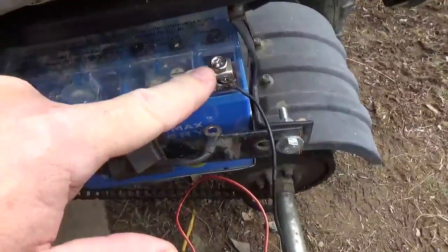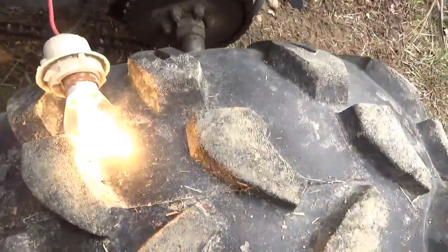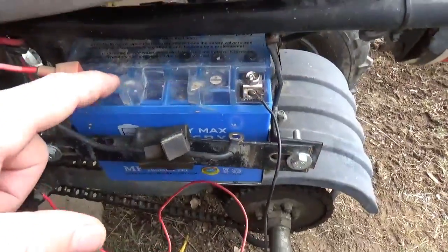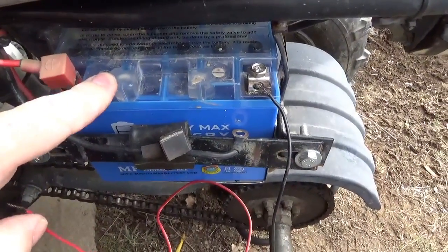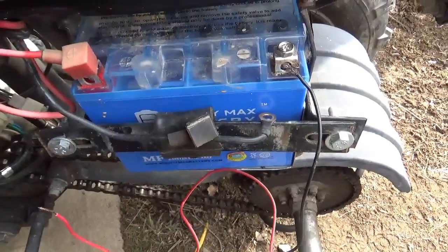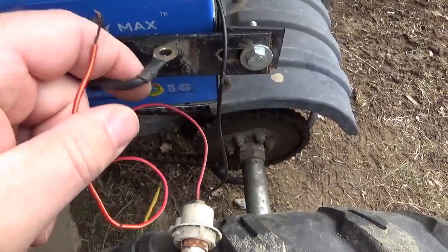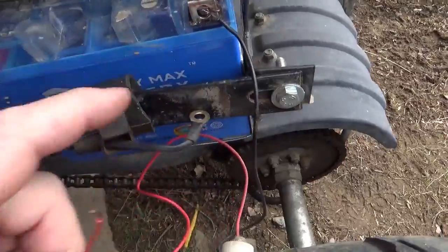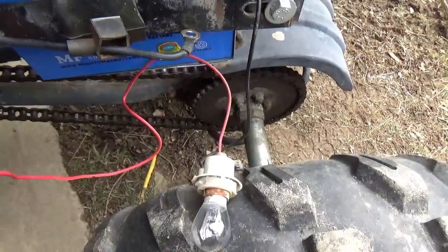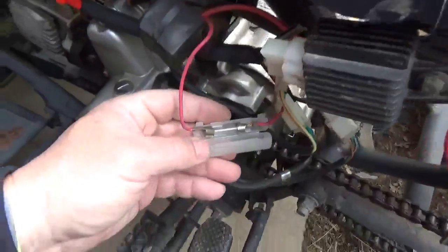I hardwired the light bulb to the ground terminal of the battery. When I touch it to the positive, you look at how bright it is and make a mental note. By the way, if you've recently charged the battery - this is a gel cell so there isn't as much issue - be careful about sparks because you really don't want the battery to go boom in your face. I'm going to hook the light bulb up in series on the ground side. The reason is if I'm messing around on the positive side and I short something, there's going to be sparks and fireworks.